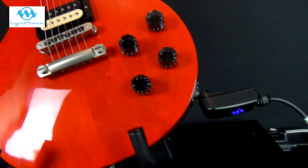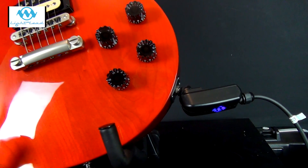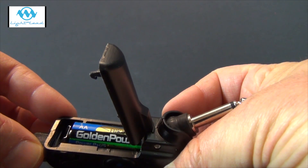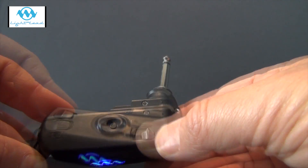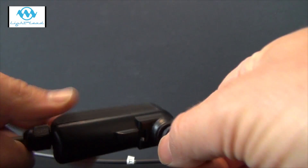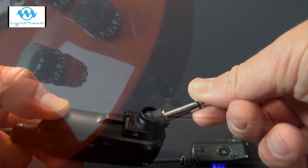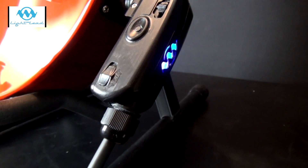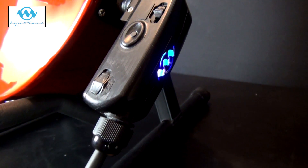Let's take a closer look at one of the prototypes. The current prototype takes a triple-A battery, one in each end. It's got a detachable cable for easy coiling and interchangeable lengths, blue LED lights, a variable capacitance switch and a movable jack. The fibre is very flexible and lightweight but also crush resistant compared with copper cable, so if you manage to somehow partially fracture the fibre, light will still pass through without any added effects to the frequency of the audio signal.